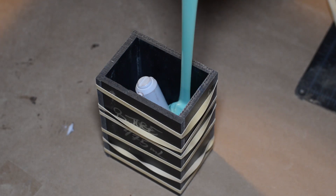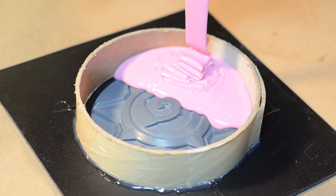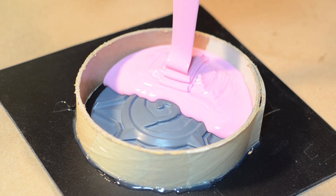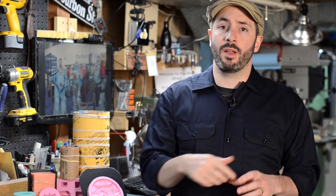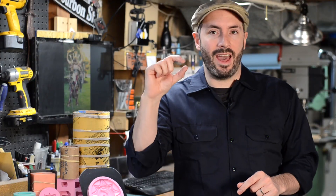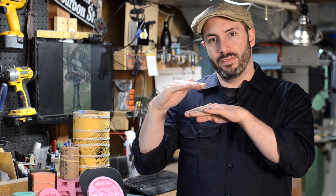The best case scenario is to pour it into the lowest spot of your mold and let it fill the mold as it goes, creeping its way over all of the little detail bits on your master. Be super patient here. You'll have to scrape down the sides of the cup a little bit, which will add some bubbles, but do that right at the end. If there are bubbles on the top of your silicone, that's not the end of the world. Make sure there's a good half inch or so between the top of your master and the top of the silicone.